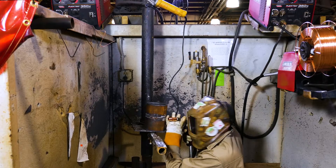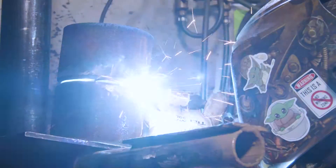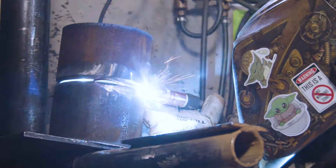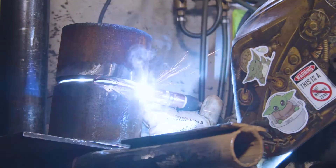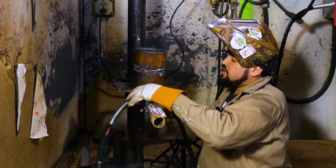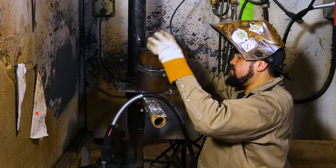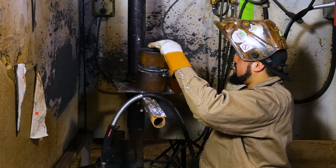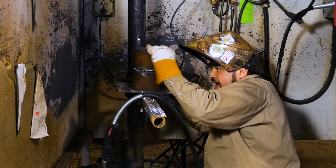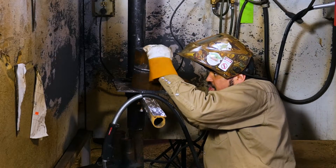Good on that shot. Just a little quarter-inch tack is all we need. After that, you're good to remove your wire, because if you tack it on the other side, what's going to happen is that wire gets stuck, and that's the last thing you want.